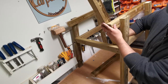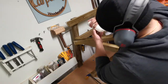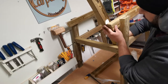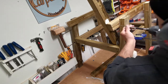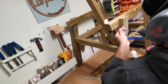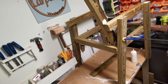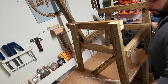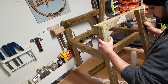This is now the piece for the backrest. You can see I angle the piece on the top and the bottom just to give it a nicer look — the angle I went for is to follow the same direction as the armrest, which is a 15 degree angle. Having some clamps in place really helps to make sure the pieces don't move, and again I just screw this in place using a bit of glue as well. You can see at most of the joints I'm using at least two to three screws, because I don't want the pieces to have any flexibility — I want it to be as strong as possible. We just repeat the same thing for the other side.